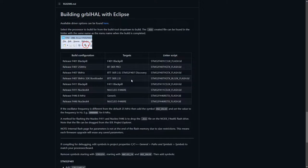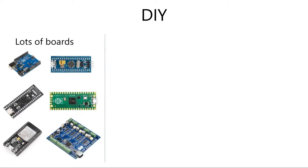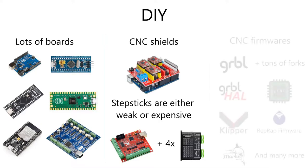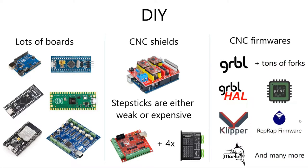The third option is DIY — truly a mix and match of anything you can find that can drive stepper motors, and this is the option I personally chose. The simplest solution is just an Arduino with a CNC shield, but the problem is that step-stick drivers are usually fairly weak. My recommendation would be to use just an Arduino and dedicated stepper motor drivers. Arduino isn't the only option — I'm using an STM32 Blue Pill simply because I had one lying around. If you check different firmwares available for CNC, you'll find a lot of microcontrollers are compatible with them.